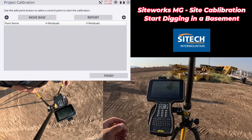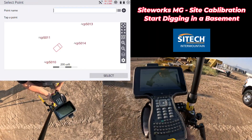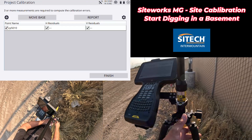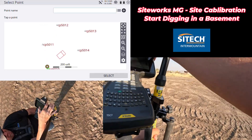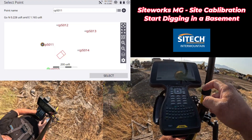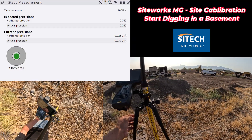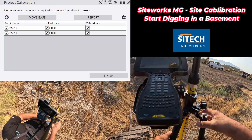To start the calibration, we'll hit the plus button and walk over to the very first control point, which is point 5010. I'll hit select. I've got my quick release on 6.562 and I'll let it do the traditional 15 seconds. One done — let's work through all the others. After hitting one, I can hit the plus button and click the next one, and it will start walking me towards where to go. A good rule of thumb: if you don't trust your bubble, try to face the same way every time you do the site calibration so you don't get 180s on your bubble. If there is error, at least the error will be consistent. Done on the second point — marching our way right around the project.